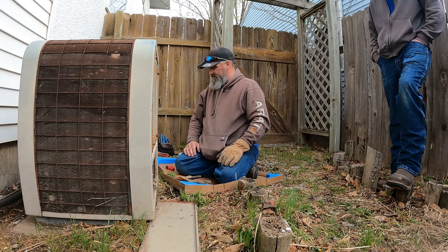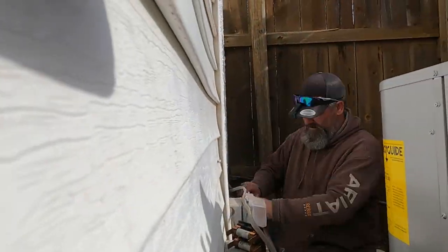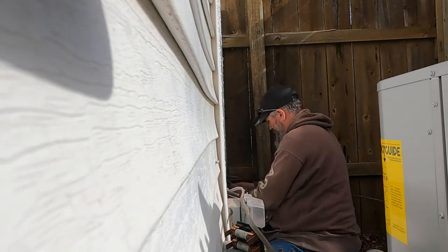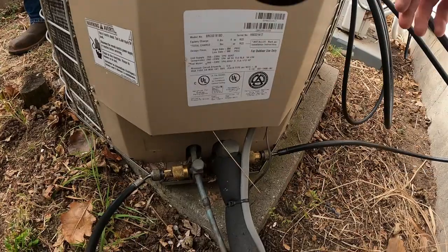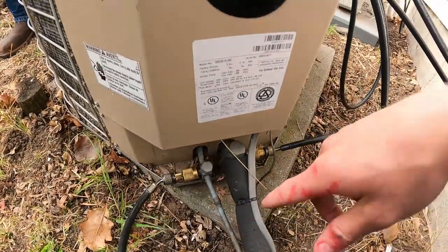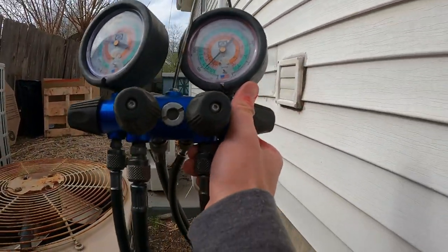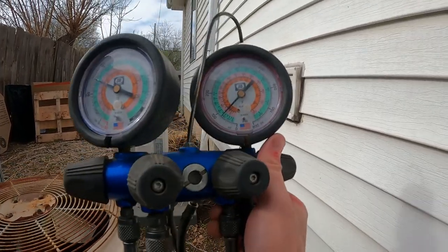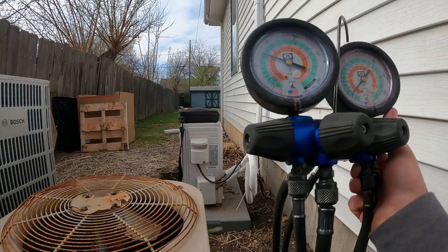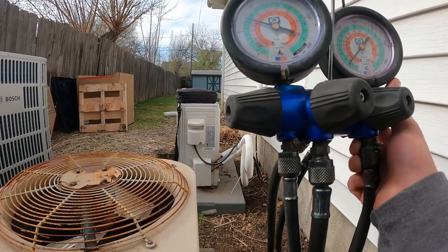It's literally bone-dry — there's not a peep of anything coming out of that, not even vapor. They were desperately ready for a new system here. Now we got them both hooked up correctly. The left side is going over to this gauge which also shows some — red is at 20 psi, blue is at 40. It's supposed to be up in the hundreds.